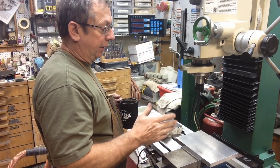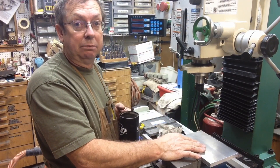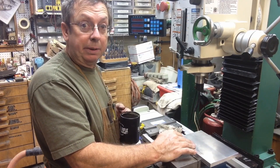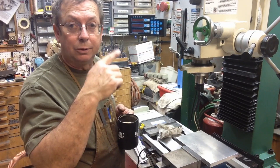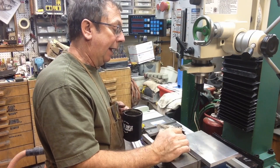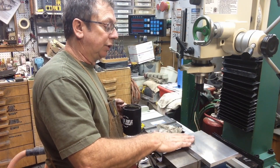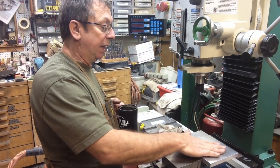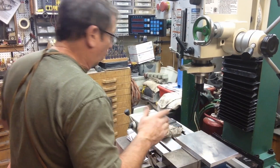What I've been doing is taking a couple of pieces of heavier stock that I showed in the last video on starting the power drawbar — I'll put a link up here someplace. That stock was pretty scabby, pretty ugly, it had been used and machined down. I went ahead and flattened out both of those and squared up the corners, so I've got two square pieces.